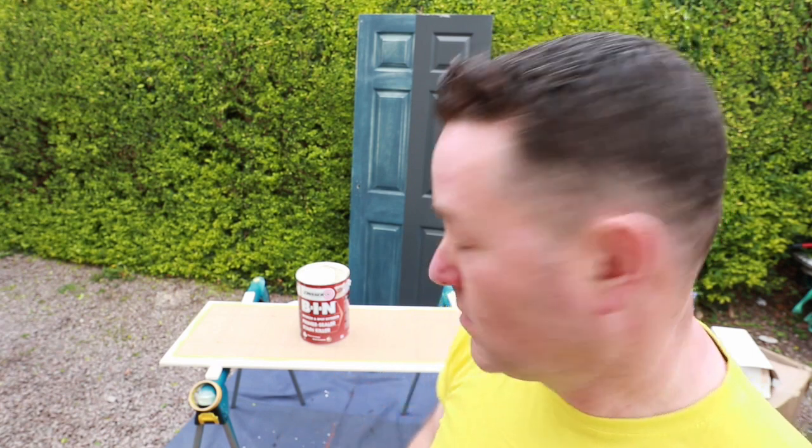And that's where you get bare wood or bare surfaces. You always put a wash coat on first, a primer coat, then you work on top of that. So always put your primer coats on, wash coats, never fill anything unless it's primed. Told you that before. So I'm just waiting for this to dry off, won't take long, 10-15 minutes.